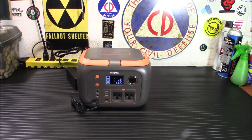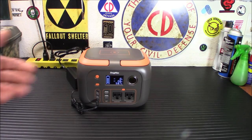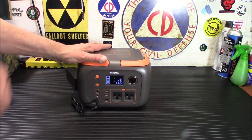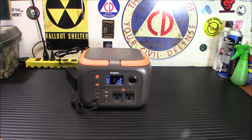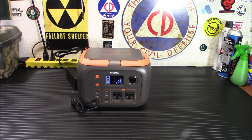We will be demonstrating it with the Snugmax solar panel, sold separately — it's a 60 watt panel. If you're an apartment person who doesn't have a place to stick a solar panel outside, you can put a solar panel in a sun-facing window, or you can always just keep it plugged in and topped off. Now, the power supply is an AC 100 to 240 volt pure sine wave inverter. The benefits of a pure sine wave inverter over a modified sine wave: items like computers have fewer issues, appliances run cooler and more efficiently, and radio and telco gear have less noise and hum. Motors will also run at their correct speed and with less heat. It is a more efficient inverter.